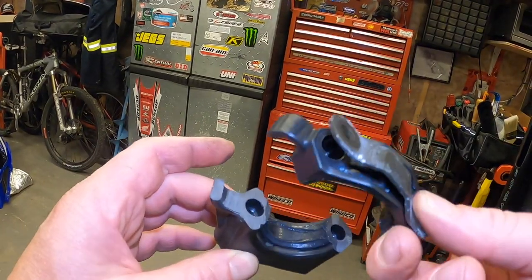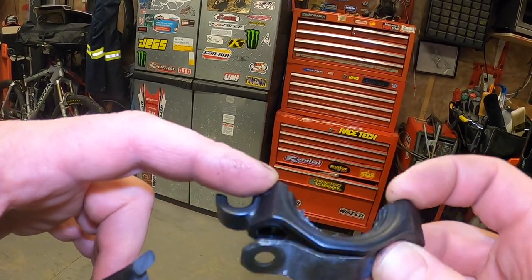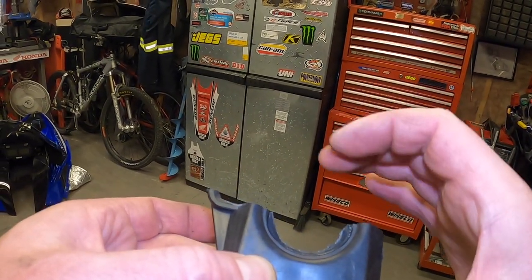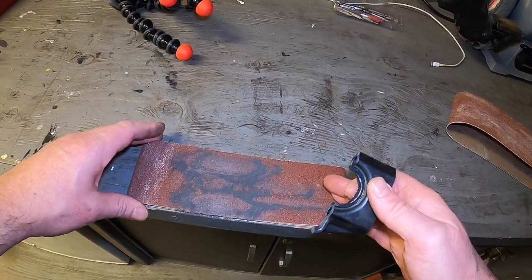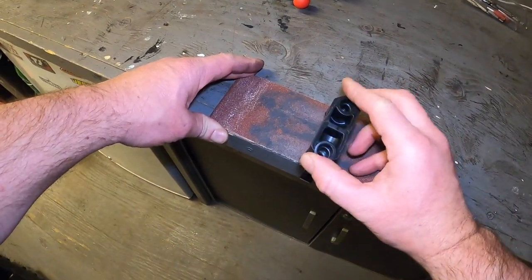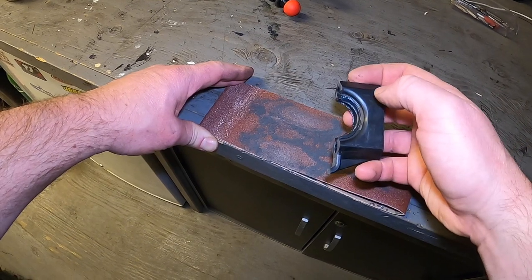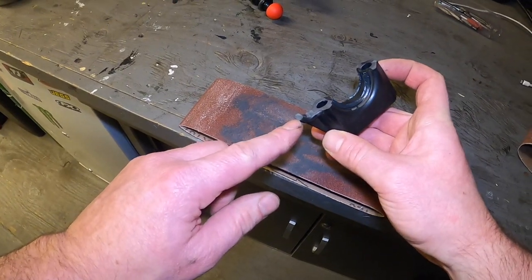The brackets mount together and you can see the locating dowels on the top mounting bracket — you don't want to grind that one down. What you want to do is sand a little bit of material off so both pieces fit together tighter around that post. I used 120-grit on a belt sander and just worked it down to take some of that material off so both pieces would fit together a lot tighter around the post.